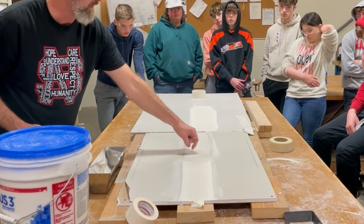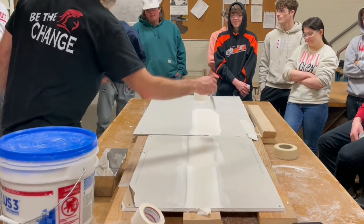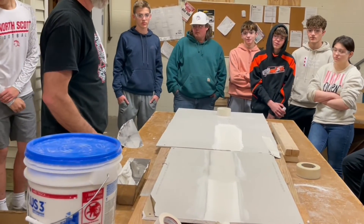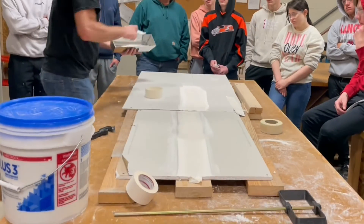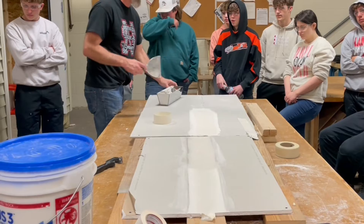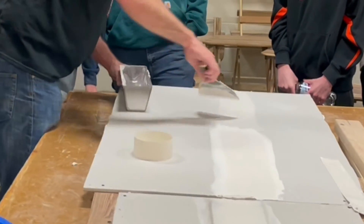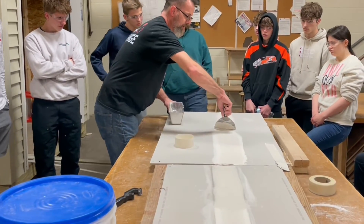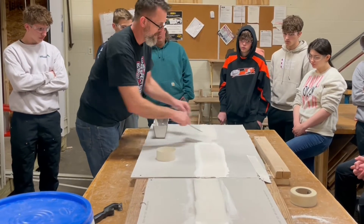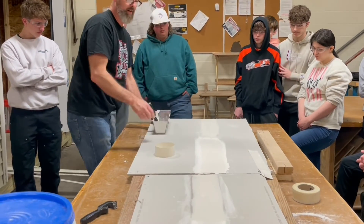That's why we don't ever put anything back inside the mud box. The goal is to have your knife run on top of the tapered edge all the way down with the tape fully encapsulated. Down here we've got a butt joint that doesn't have that recess for the tape to sit down inside. We know we're going to throw our mud down, and if I don't have much mud right there — is that going to stick? No, it's not going to stick. If it's too thin or missing in parts, I'm going to have issues. So I want to make sure that I have ample mud for that tape to stick to.